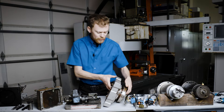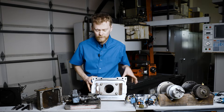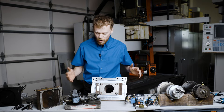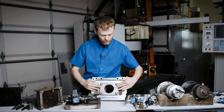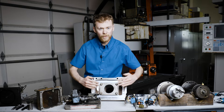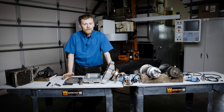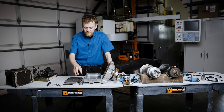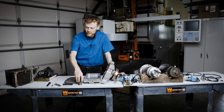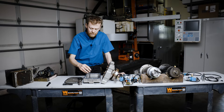This is a super speed machine tool release piston, and I don't have a 50 taper here, but this is the majority of the pistons. All the pistons work the same way, in that air pressure gets put into this square piston and the piston pushes forward to unclamp the drawbar. There are not a lot of parts to a TRP, or a tool release piston. This here is the cylinder, and this is the piston. This is the return spring, and then this is the piston driver inside of it, and on the end of it is a hex bolt that contacts the drawbar.